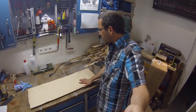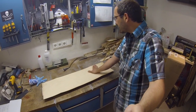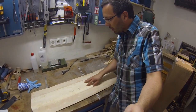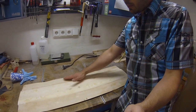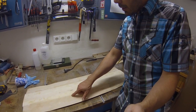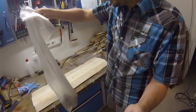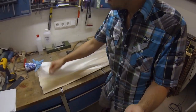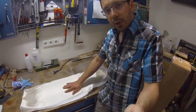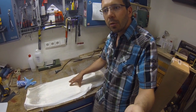You can already tell that standing here behind the drop and between the flares will feel quite good — you'll feel that. Now we've applied the reinforcement in the middle, which I've already sanded down to the edge here, to now put the final layer on top. Because there's always a gap here, and to now strengthen the bonding a bit with another layer, I'll put in a light 220-gram glass layer for gap bridging.